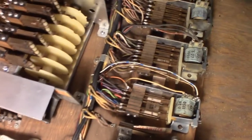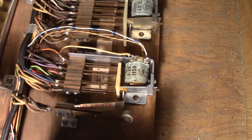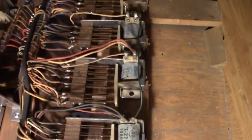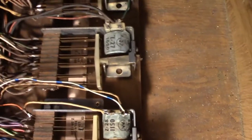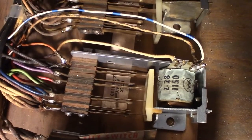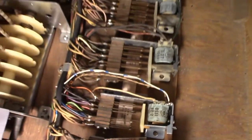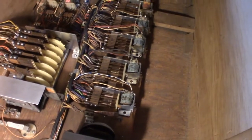The wires go over to the motor board — there's the lock coil. The white-blue wire is the one I connected there. You can see there are other wires doubled up going to coils, so it looks stock, like it should be. The other new wire connects down at the far end where you see that orange wire. That's basically how you do it — it works out great, no problems, and the coin door looks nice and clean on the inside.